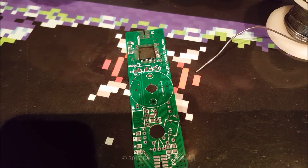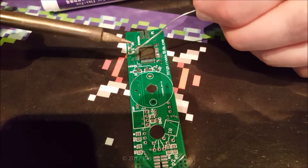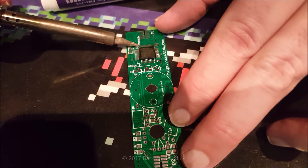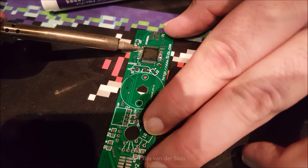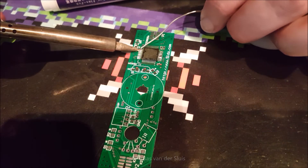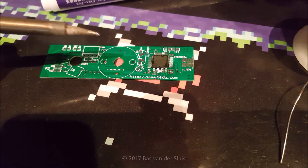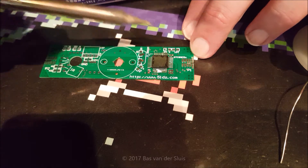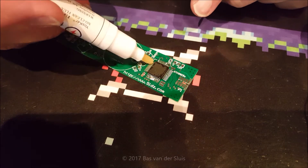I only messed up this side so far. Let's put more flux on there — we want more. Let's clean the iron again, put some solder on it, and hit all the pads. And this stings bad. It doesn't look pretty, but it looks soldered. Let's see — we want more flux on there. Now that looks good, actually. Let's see if we can put a bit of flux on there and remove the excess — we can, actually.